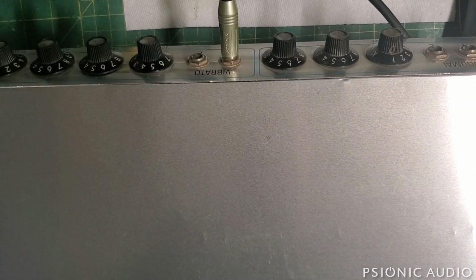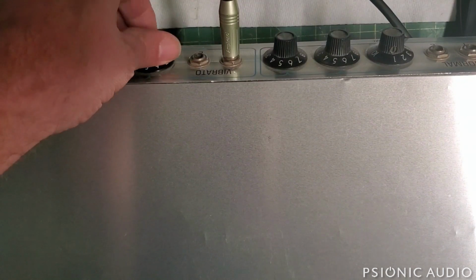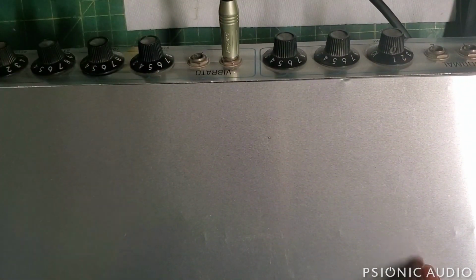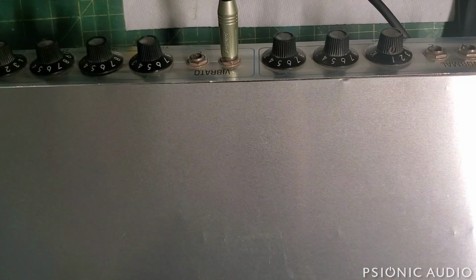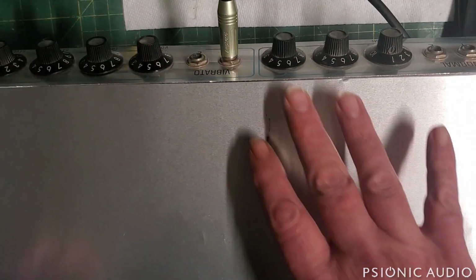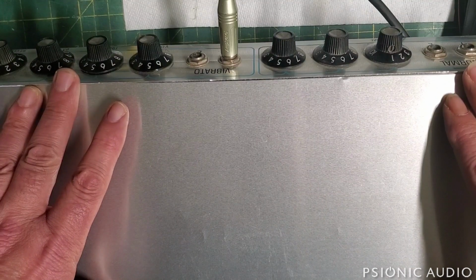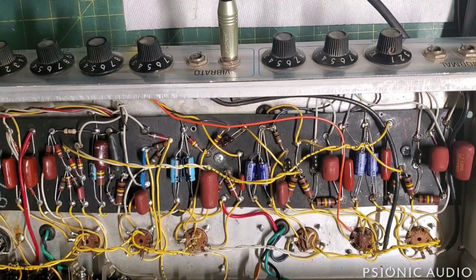It had a very noisy old 7025 in V2, so that there was a bad noise at all times on the reverb channel, the vibrato channel. And this is the actual self noise of that channel now. I moved one of the other old 7025s to V2 and put a Tung-Sol in the tremolo driver. Put the more expensive tubes where they matter. So this is the actual noise floor of the amp. This is the noise floor when it's on the bench.